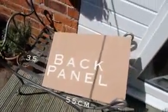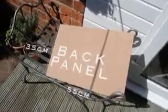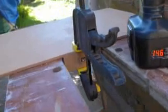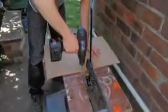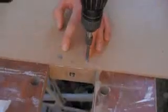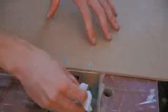Use some glue to stick it all together. Next cut out a 55 by 35cm sheet out of 6mm MDF — this is going to be the main structural panel. Clamp the tripod mount to the middle of one of the longer edges of this panel with the tripod thread facing outwards and drill two holes through the panel and into the tripod mount. These are pilot holes for screws, but before screwing them in add some glue to the tripod mount for extra strength. Make sure you countersink the screws so that they end up flush with the front of the panel.